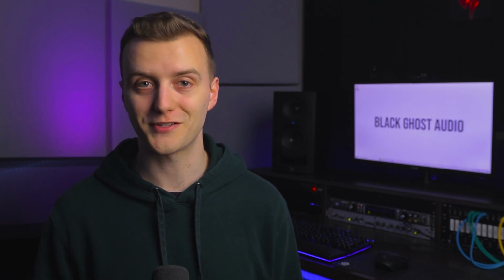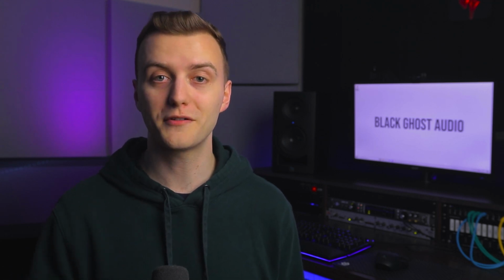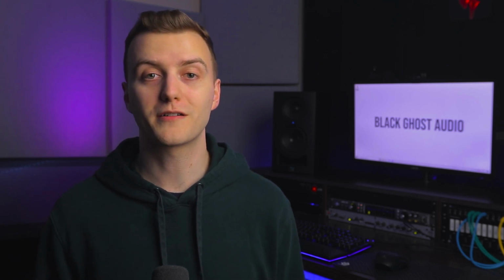Studio monitors are typically either biamped or triamped, which is the practice of using 2 or 3 audio amplifiers to amplify different frequency ranges. The incoming signal is split using a component called a crossover. The split signals are then each sent to their own respective driver. Studio monitors with 2 drivers are called two-way monitors, and studio monitors with 3 drivers are called three-way monitors. A two-way monitor may contain a woofer, which is a low-range driver, and a tweeter, which is a high-range driver. A three-way monitor often includes a woofer, mid-range driver, and tweeter.